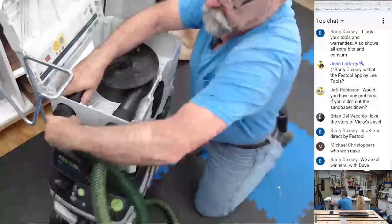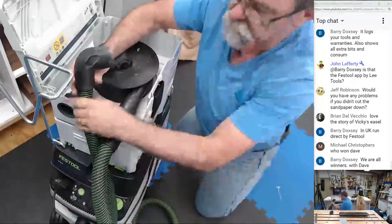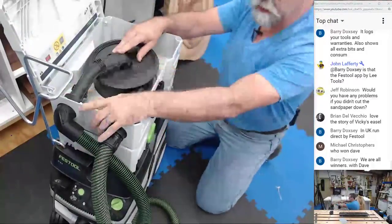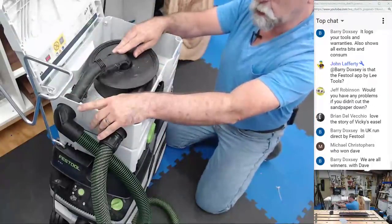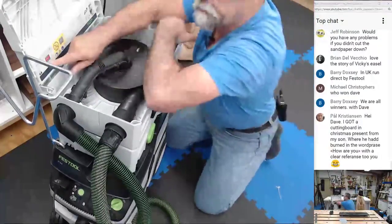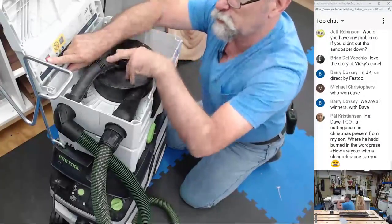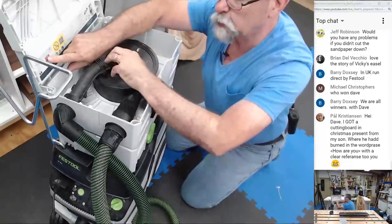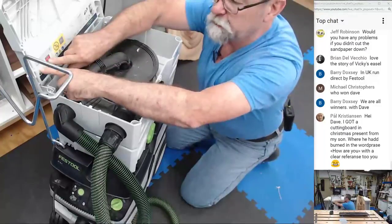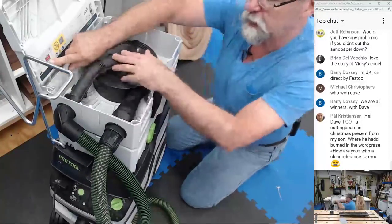It comes with this connecting hose that goes, it's anti-static, of course, all the way down to your main section there. It's about a 27 millimeter hose. I was thinking about whether or not you could put a 36 millimeter hose. I'm sure you can. And that might increase the cubic meters an hour. So it says on the side here, 27 millimeter hoses, 3.5 meters long. This will, at full speed, going to your dusty, will pull 41 cubic meters an hour. With a 32 millimeter hose, 58 cubic meters an hour. With a 36 millimeter hose, 3.5 meters long, 73 cubic meters an hour.